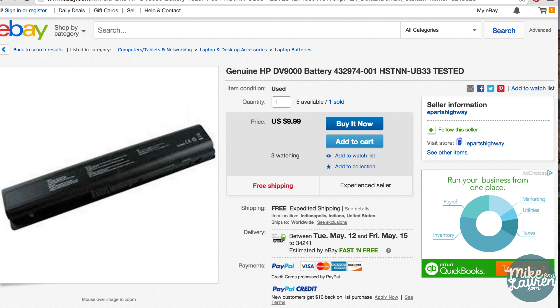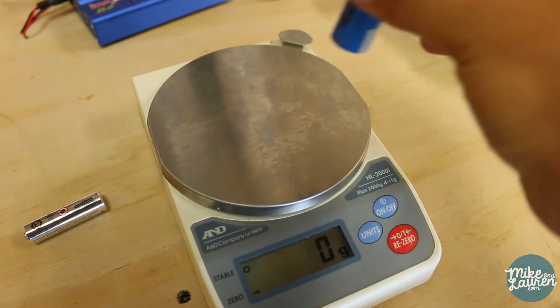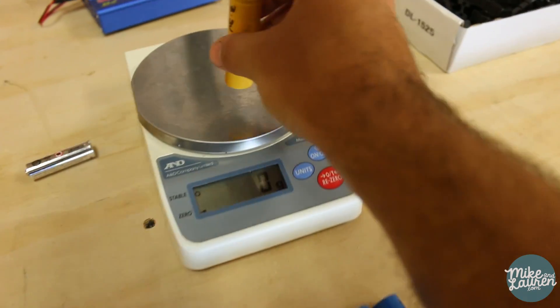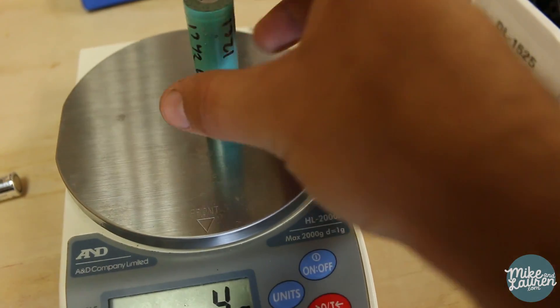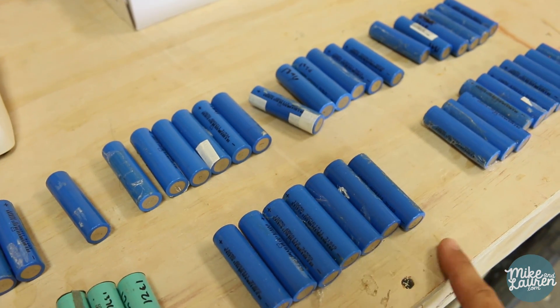The workaround is to buy new old stock laptop batteries off eBay for anywhere between ten and twenty dollars a piece. They'll have six to twelve cells inside and you can often get the price per cell down to a dollar or two. I ended up paying just over a hundred dollars for thirteen laptop batteries with six cells in each. One way to tell if you've got a quality 18650 is by weighing it — a brand name battery should weigh 43 grams. These blue ones are right on target, but these cheap knockoffs are a gram or two short, meaning they came out of a Chinese aftermarket battery rather than a genuine HP, Dell, or Lenovo.